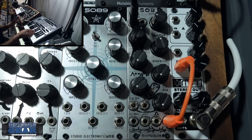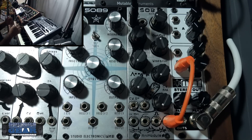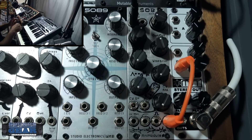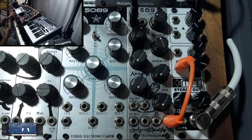One of my favorite parts of this thing is actually the vactrol. Basically a vactrol is like a light-based little circuit - it has a resistor and an LED in there, and it controls the resistance based on the light. It's really useful for triggering the cutoff. If you turn the vactrol all the way up and turn the cutoff down, you can open up the filter by applying a trigger to the vactrol input.